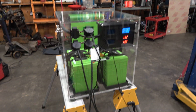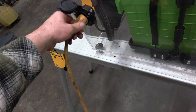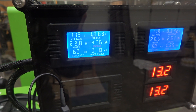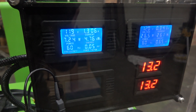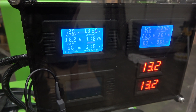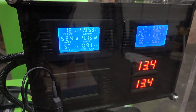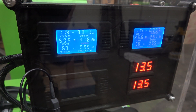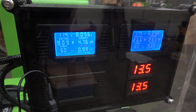Now that we've pulled a few watt hours out of these batteries running the saw and heat gun, we're going to plug in wall power. The second screen is lit up. We're starting at just one amp and it's going to initiate the charge cycle. In just a second you'll see the power and amperage go up, and a corresponding rise in battery voltage. Now we see about 900 watts — that'll stay under the capacity of my Honda EU1000i generator. The battery voltage has jumped up and the inverter is taking care of a good battery charge cycle.